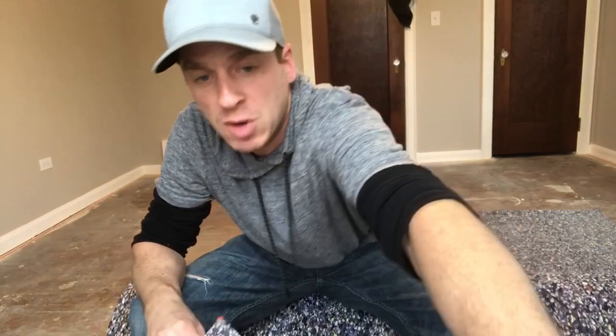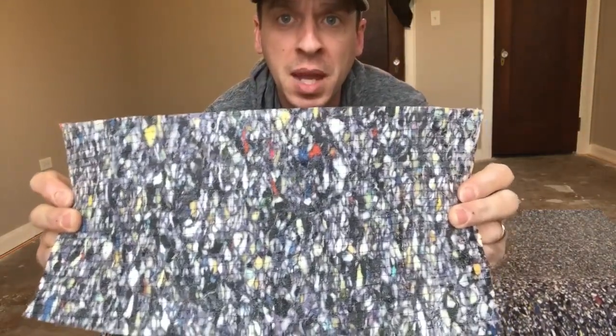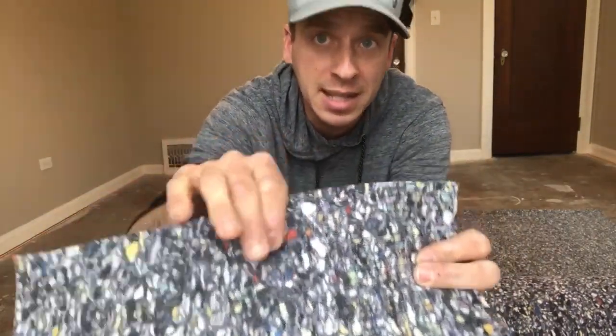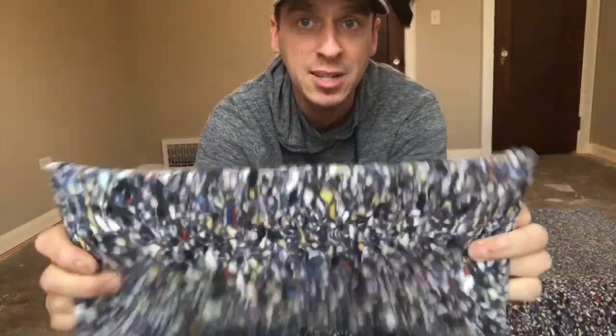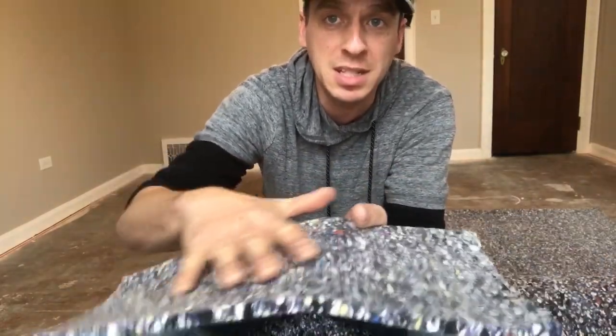What's going on everybody? It's Michael Alder here from CarpetExpertBlueprint.com and in this video I'm going to share with you how to install carpet padding over a wood subfloor. Now first things first, I've noticed some DIY types get this confused. This is a 7/16th 8-pound carpet padding. On the top here we have a net-like finish going across it — you want that on top. We flip it over, there's no net, there's no sheen to it. You want that net on top, that way when you stretch the carpet it's going to slide and you're going to be able to get a better stretch on it.